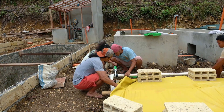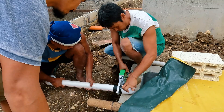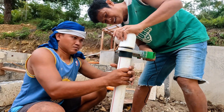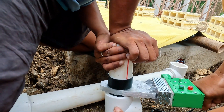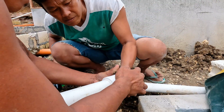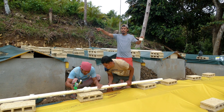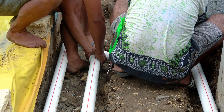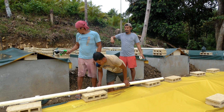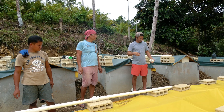This was a learning process for me too. Usually in the United States we'd just use solvent and glue to put pipes together, but over here for the thicker stronger pipes we actually weld or melt the seams together with a special contraption. Once it's melted, it cools, binds, and becomes as solid as a single piece of pipe. Installing the supply line, we tried to keep equal distance to all the ponds within four feet of each other so pressure is evenly distributed, then fine-tuned with valves. This pond supplies five planters.